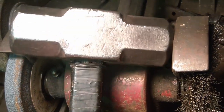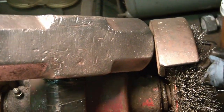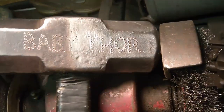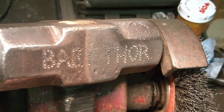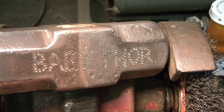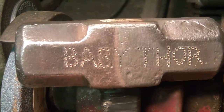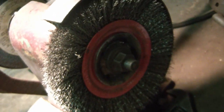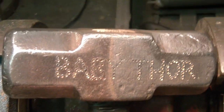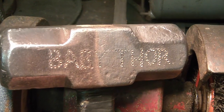I've been wire brushing with the wire wheel now that it's been turned around and got a little carried away. You can see the 'Thor' and the 'Y' are now wire brushed with the wheel having been turned around, hitting at a much more aggressive angle. The 'BAB' shows what the wire brush would do before I turned it around. It's probably been about two years since I flipped it, so I didn't realize how bad it had gotten. If your wires are all bent one way, flip it over — it'll be like a whole new wire brush.